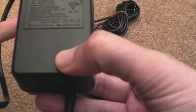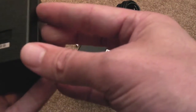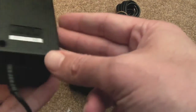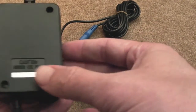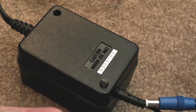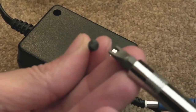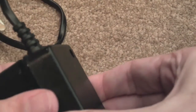These are quite heavy - it's going to be an AC transformer stepping down from 240 volts here in the UK down to about 9 volts. There's no rectification in the power supply itself; it's all AC output handled in the SNES. So other than maybe a couple of safety caps and an inline fuse as well as the thermal fuse, there's not going to be much more in there. I'll just get inside now. You need one of these screwdriver bits - it fits snugly onto the security screw head, which has a little rectangular slot. As long as you get the right size bit you should be able to get it out. Both screws are out, so let's carefully ease this apart and have a look.